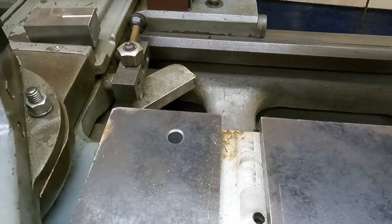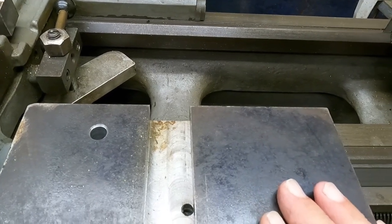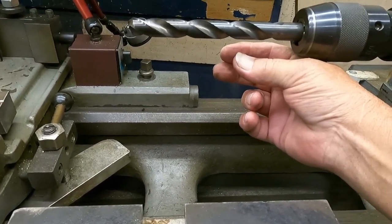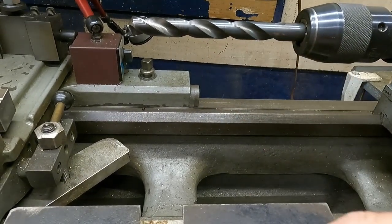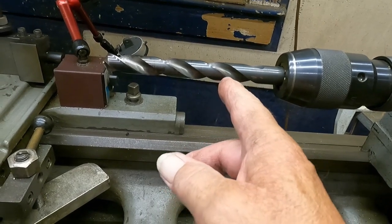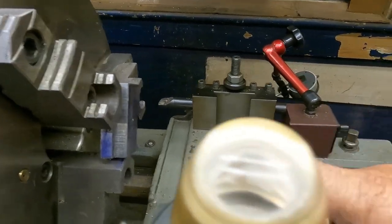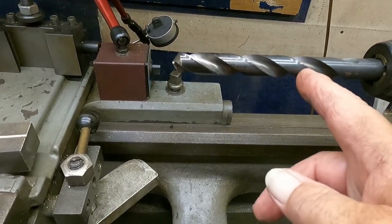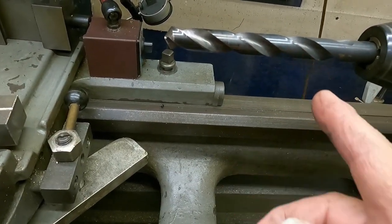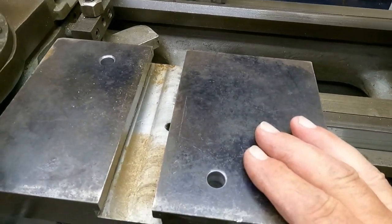Number two, I've seen something recently, and it would be built over here, and let's say you've got an arm coming out here and coming up, and you could attach a shape to it, and then we've got another bar coming up from here and running into that with a stylus, and that stylus will be on the same line as the cutter on the lathe, so I can feed in and out on that stylus while making that cut over on my left, tracing the pattern. So I'm going to try to mount some kind of tracing attachment on here.